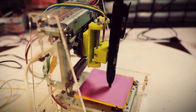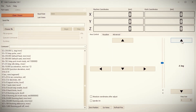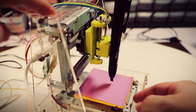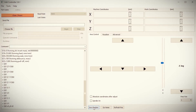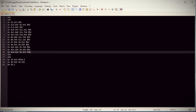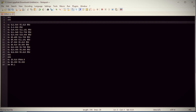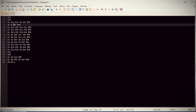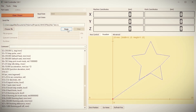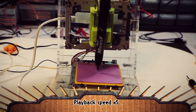The Z-axis movements are going to be kind of tricky, so let's figure them out. Start by moving the pen all the way down until it touches the surface. Now in the software use the Z buttons to move the axis up about 2 millimeters. While you're at it, move the X and Y axes all the way to their starting points. Then click the zero position button to reset the axis coordinates to zero. You can close and reopen the Arduino connection so that all the coordinates show as zero. Now back in the g-code, get rid of the initial Z command, and for the second Z command set it to move 2 millimeters down. Then it will draw the shape, and at the end of the code change the final Z command to go back up to the zero position. Save it, load it up in Grbl Controller by clicking Choose File, and then click Begin to send it to the machine.